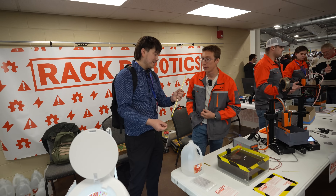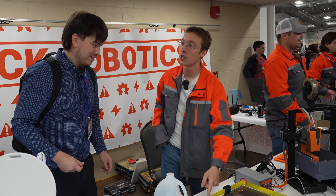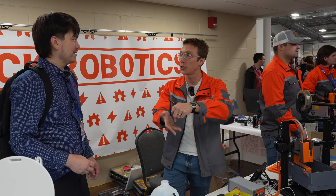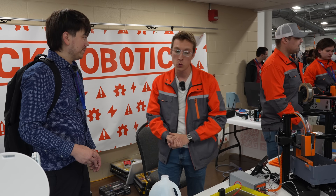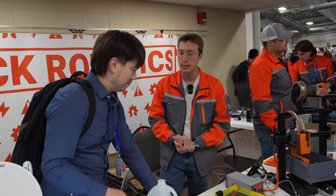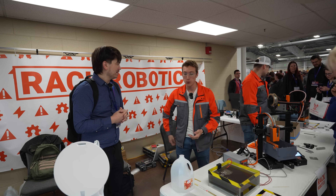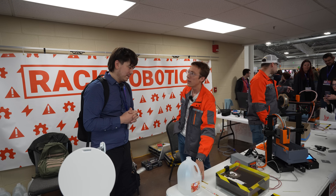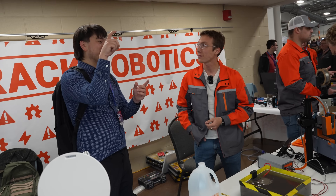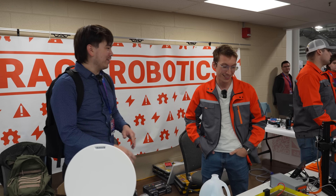Is this a tube? Yeah, that's a tube — I think a 0.5 millimeter OD tube. Why is it a tube? That's so you can flush dielectric through it. If you're trying to do a high aspect ratio hole, you're going to want to either pump water or oil through that, or pull it through, to get the waste cleared away so you can do that super long aspect ratio hole. One of the people we've been working with — Michael from the Rotoforge project — did a 120-to-1 aspect ratio hole. A regular drill bit can only do about 10-to-1. He was doing it at either 0.5 or 0.3 millimeter for a glow plug 3D printer hot end project. There are so many things you could do with this — the applications are almost limitless.